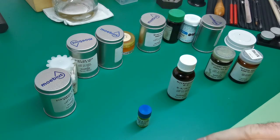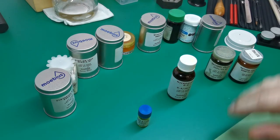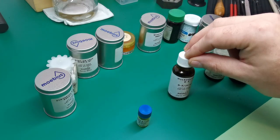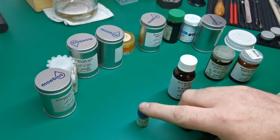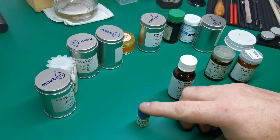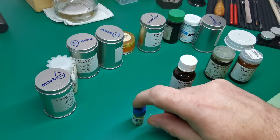So these three lubricants cover three different categories: you have a grease which is fairly thick but not super thick, then a medium oil, and then the 9010 which is a very fine oil. The 9010 is good for very fast moving parts — things such as balance jewels, pallet stones, train wheel gears, fast moving escape wheels, and pallet staff pivot points.